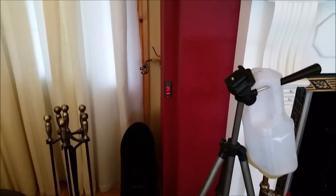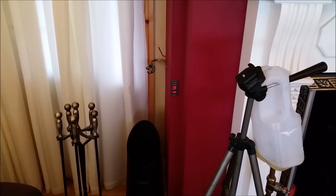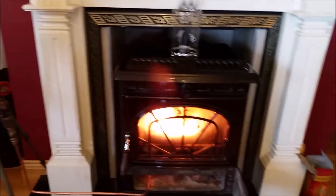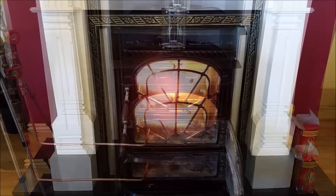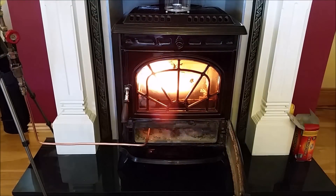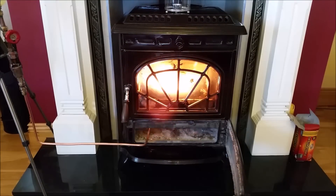That's probably 50,000 BTUs or something like that to the water, and you can see it rising — 57.4, 57.5. Every time it hits 60 it sends heat out to the system, and when it drops to 55 it shuts off. I can increase the burn rate by giving it more fuel. We've been going about 40 minutes on about a litre and a half of fuel with no problem raising temperature at all. It's burning pretty clean — if it catches the glass it leaves it darkened a bit, but by and large it's pretty good.